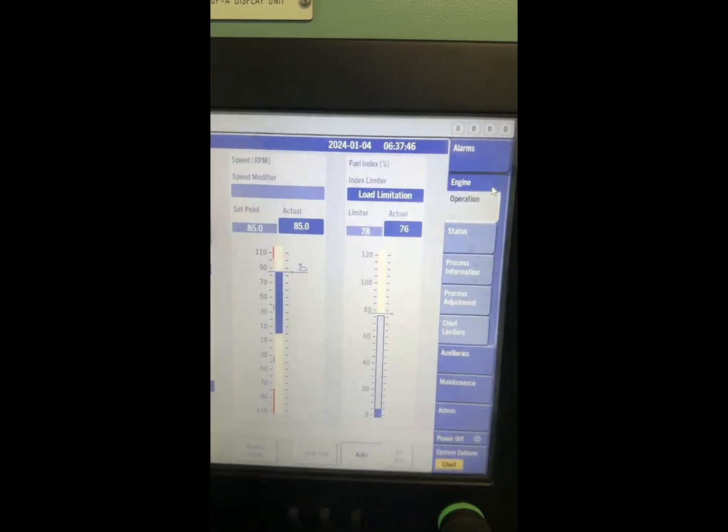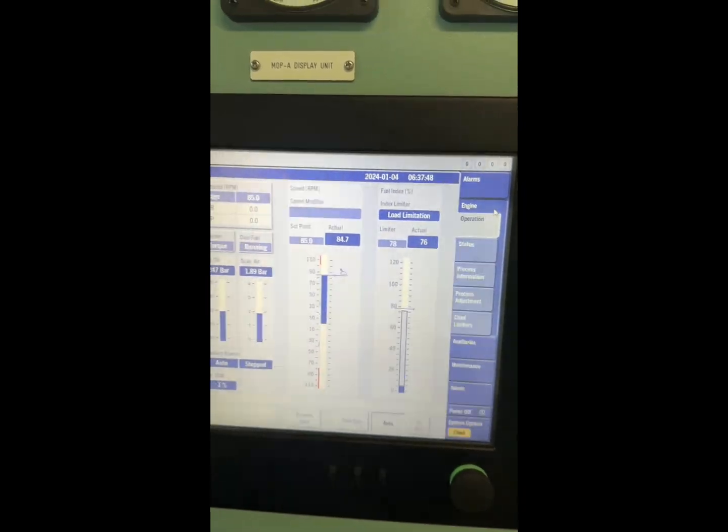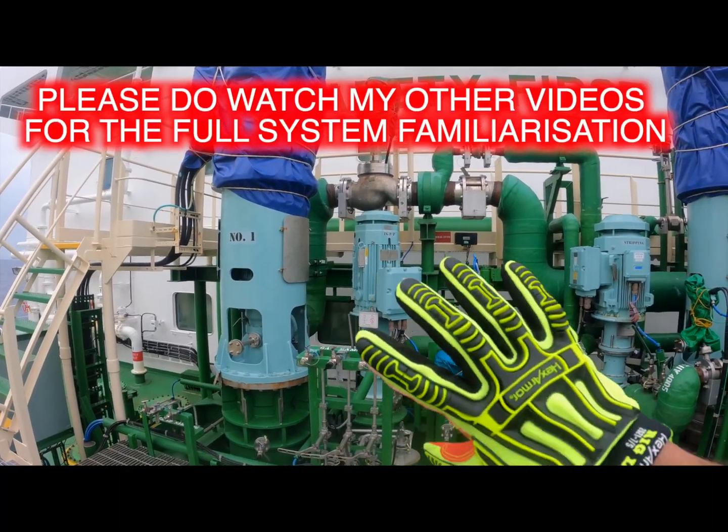Very visible even from the main index — the lighter color is the gas, the darker color is the fuel index — the pilot fuel in dual fuel running. The SF pipes — SF means secondary fuel. That's a good trial in gas: gas running good, systems running okay.